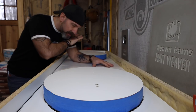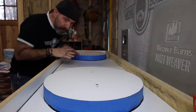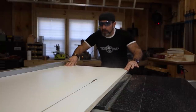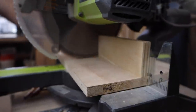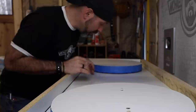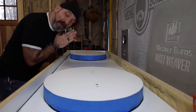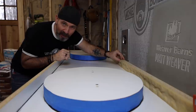This project is all about the mold, and as you can see, there's actually a lot going on with this mold. Not only do we have our melamine box, but we also have these knockouts and this nice edge mold. This particular double vanity is 67 inches wide by 19 and a quarter deep. I cut all my sides at two and three quarters to give me this two-inch depth, and the only reason I went two inches on this particular project is because my edge mold is two inches.